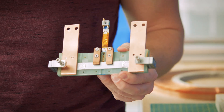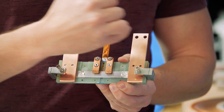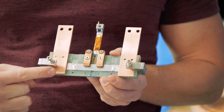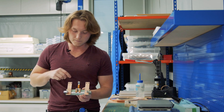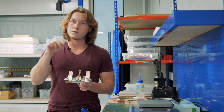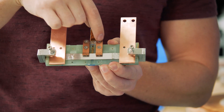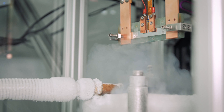What we've got here is the little setup we use. We've got a short sample about 12 centimeters long, strapped between two current leads — the positive current lead to push current in, it will flow across this silvery tape here, and the negative current lead which will pull the current out the other side. At the same time, these two little bits of copper have tiny little pressure screws underneath which act as voltage taps — metal contacts to the tape — and we measure the voltage drop between these two points so we can push the current through and measure what's happening across the tape.